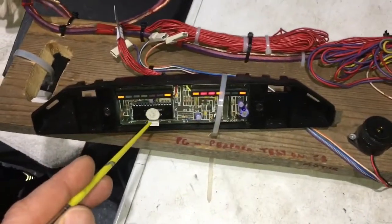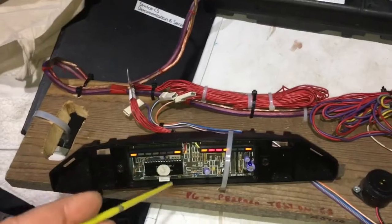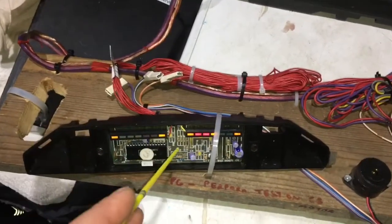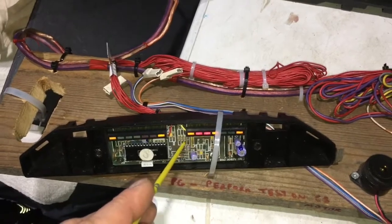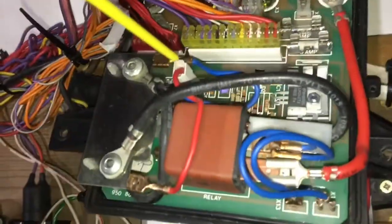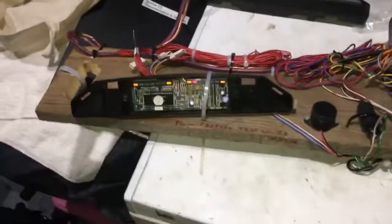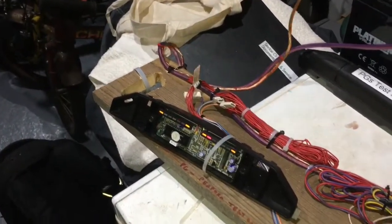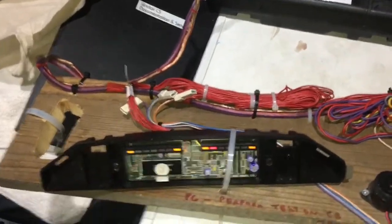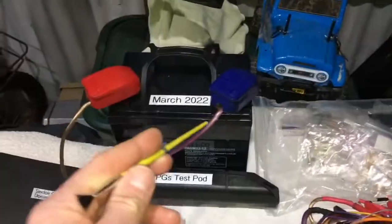I'll see if the owner wants me to put in a Jeff Wells chip. The instructions are on the internet but I've done a few - basically you have to remove one of the resistors down here, cut or remove one of the red wires here, and solder a resistor between two of the pins on IC2 on the back of the board. That's the general gist of it. Otherwise pressing the throttle will just start to beep once it drops to the last level.